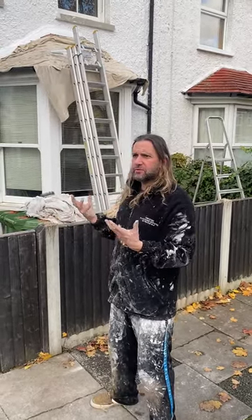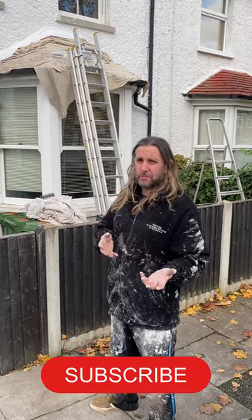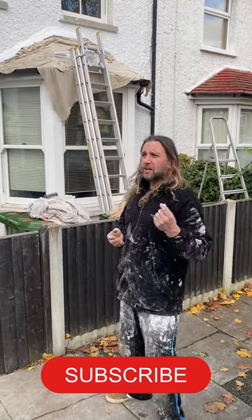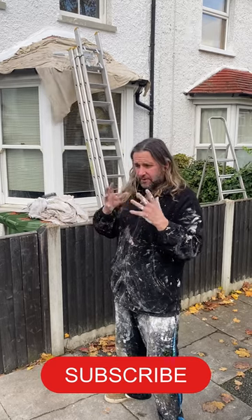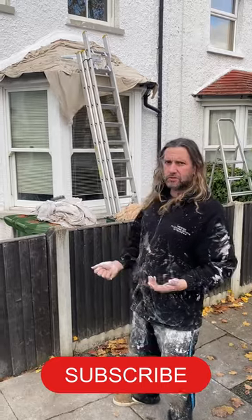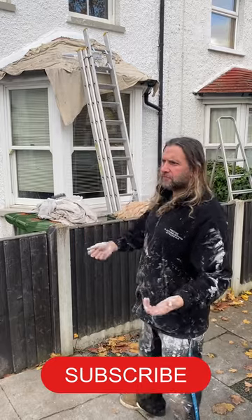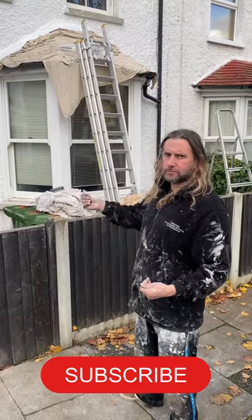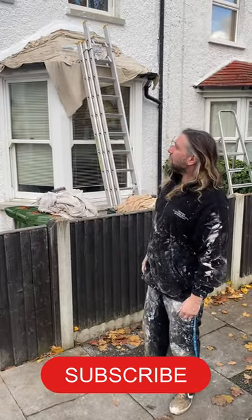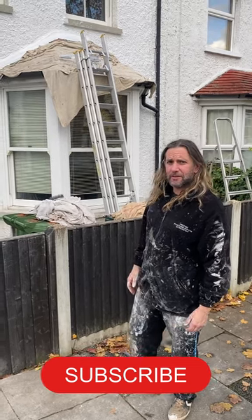If the surface isn't solid, it's not going to hold the paint, or if it does it'll peel and crack very quickly and go further. It needs to be treated beforehand, so it does take time — get a wire brush on it, chip into it a little with a screwdriver if needed depending how bad it is. Repair it first before you paint, and then you're good to go. The effects are so much better than if you'd left it.